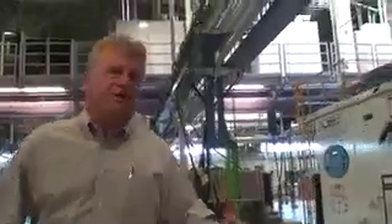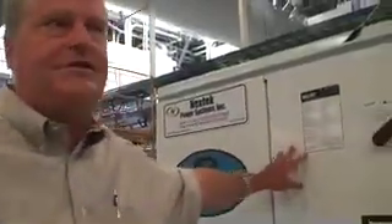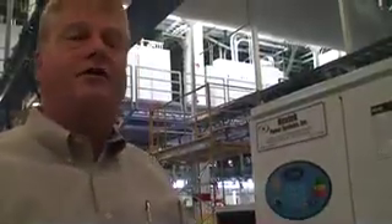There are racks of servers lined up at 380 volts DC. We also have an optional rectifier on the other end, which provides the same functionality as the first one but gives us the capability to show two different rectifier approaches. Additionally, DC lights are applied above — they're turned off today but run from the DC bus at 380 volts, with four banks of lights to show that capability.